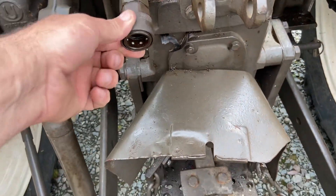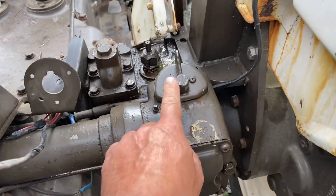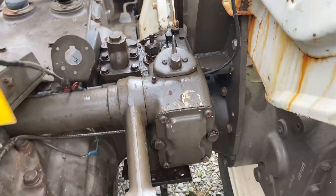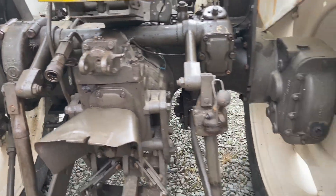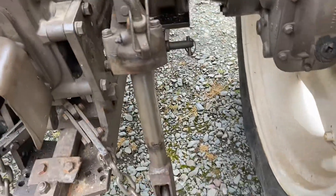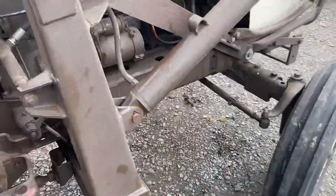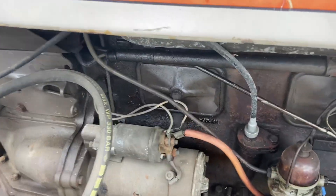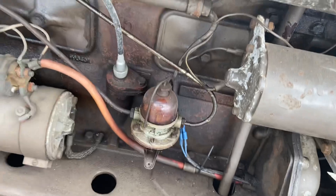This is your tipper pipe — you're going to put the tipping trailer on. This is the one I told you about the other day. Best left alone unless you're going to be doing some ploughing. This is just to adjust that leg there. If you wanted to get something level, you can adjust the height of this one; that one stays fixed in position. Starter motor — if you've run out of fuel, you're going to have to pump that there to prime it up again.